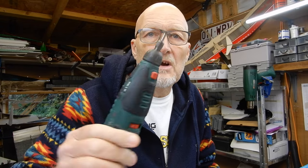I'll get back to you. Oh, so cutting the hole, you could use, so caution, you could use just a knife. Excuse me, I'm still recovering from COVID from 3 weeks ago. Right, so you could cut a hole with a sharp knife and then sort of flick the bits out. You can use a little small pointed end to a soldering iron. Please do it outside, or make sure it's well ventilated. Or the other thing is, you could use a small milling type burr and mill it out using this type of Dremel.